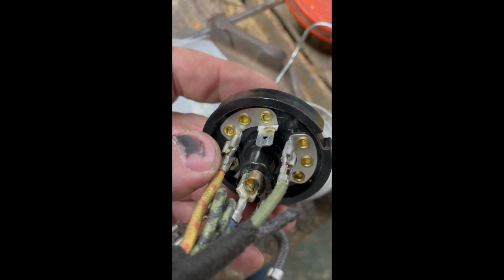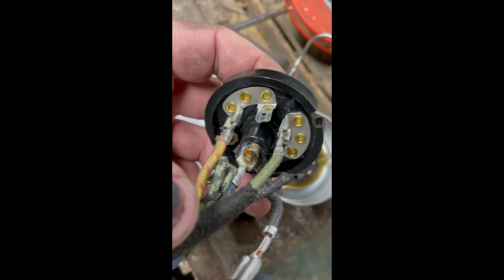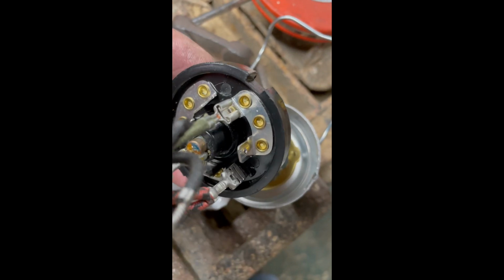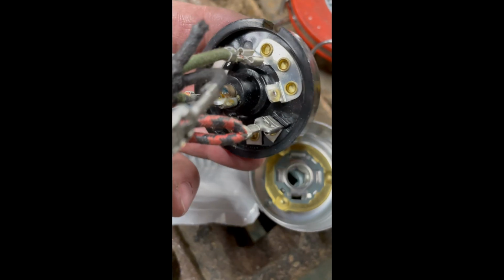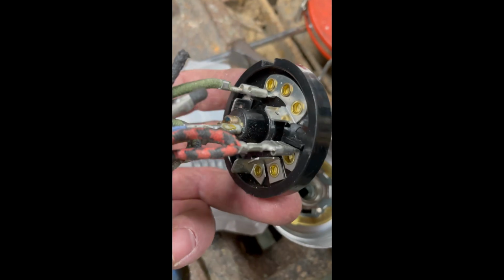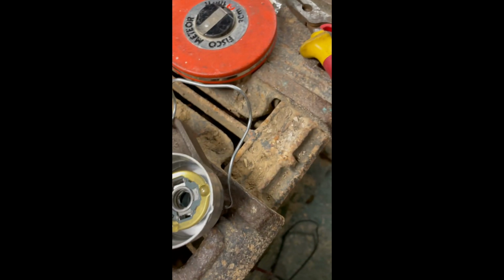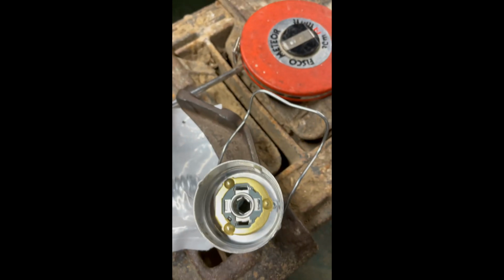So to replicate that, I've had to remove some of these. So that comes from the Dynamo, that goes to the battery, or vice versa, coming back down to power the lights. And then you've got this, the red and black one, which goes off to the lamps effectively. There's two wires because it goes to the left and the right hand lamp, but I'll have to split that off again in there to do the rear lamp off of this one, so I'll have to put another fabric covered wire in, or what I was thinking of doing was actually hijacking the earth wire there and using that.